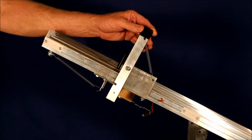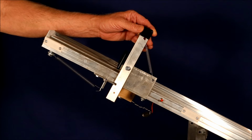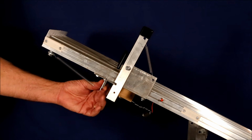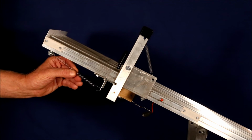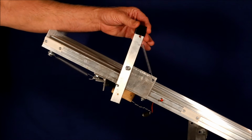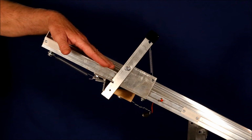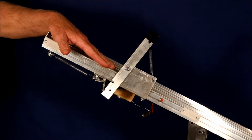The standard start gate that comes with an aluminum Besttrack is a reliable, sturdy design that's good for thousands of releases. However, the weight of the gate itself and the strength of the springs are such that when released, it shakes the track very slightly up and down. Normally, this isn't an issue, but if you're using high-performance cars, because they are notoriously light in the nose, it can cause them to bounce, and that will result in uneven starts.